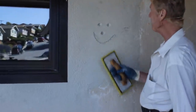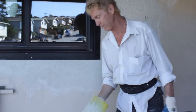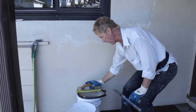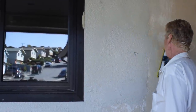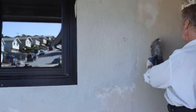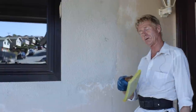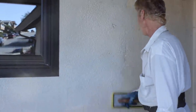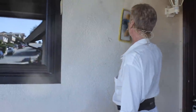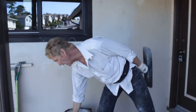This material is good for interior and exterior. It's sticky, and now you can see the float is getting full of aggregate. This is lime plaster by the way — made from limestone. As you bring the float out to match this surface, we call it a float finish in my industry because we use floats, but you folks know it as a sand finish. We're bringing the sand — the aggregates — out.